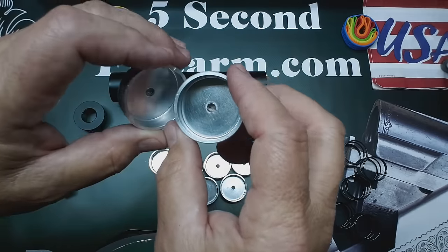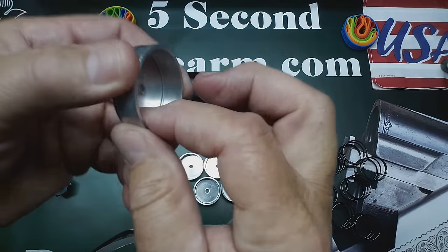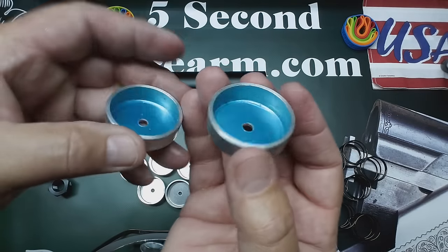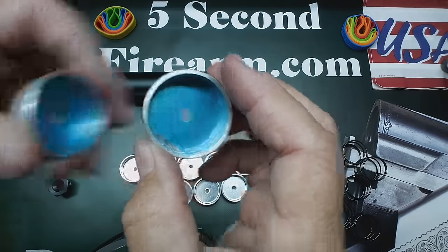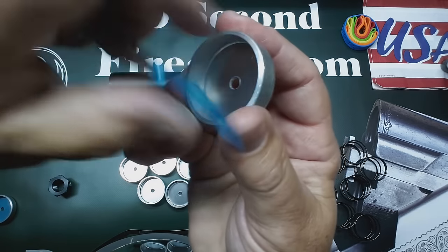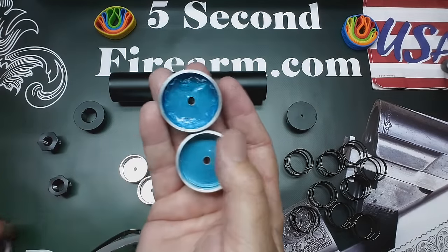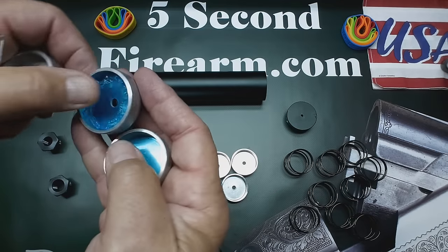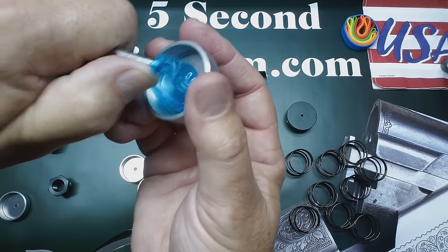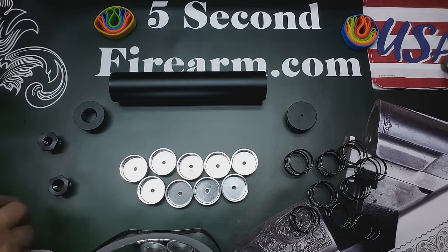Some manufacturers of aluminum cups actually heat the aluminum up and pour it into a mold — we do not do that, because you lose some of the strength of the aluminum. What we do instead is cold stamp them out of a plate using a press — like a 30-ton press — and here's how they come off the plate to us; you can see the blue protector on the plate. We remove the center plate protector and that gives us our cup. There are definitely temperature and stress-rated differences in this method, and over 24 years we've found that cold stamping with a press gives you a much more solid, stronger cup. So 9 of those cups are included in the kit.